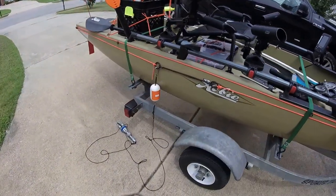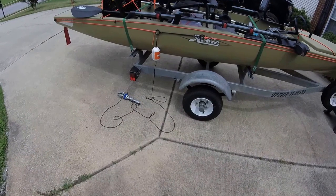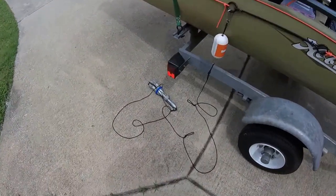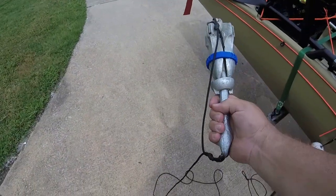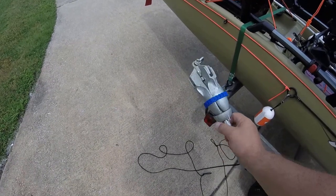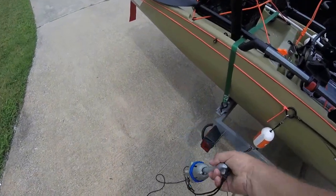Here's my anchor trolley. I've got it set up with 15 feet of cord on my anchor, with loops tied at three-foot increments so I can adjust the depth I want to hold my anchor at just by using different loops. On the anchor itself, you've got to set it up with basically a trip clip. If you don't do this, you will find yourself leaving your anchor at the bottom of the lake at one point or another. I use one of those rubber band bracelets to secure my anchor when it's in my crate so it doesn't come open.